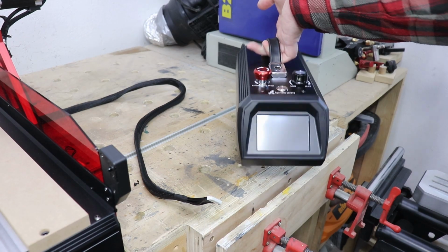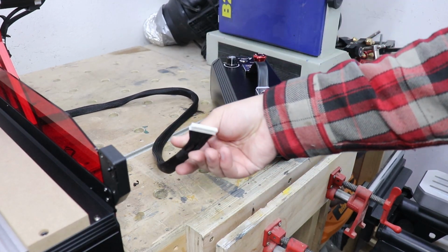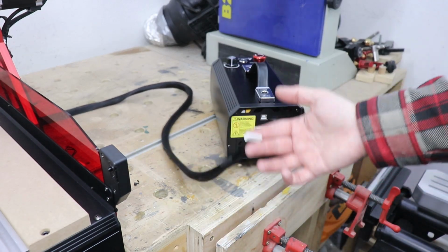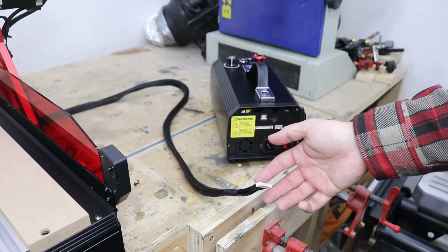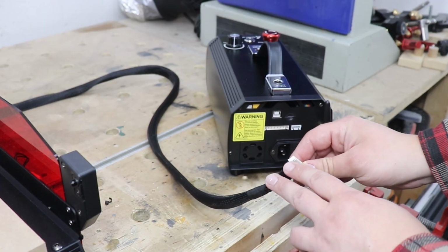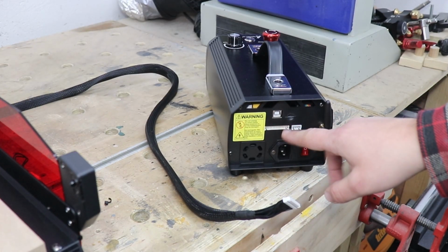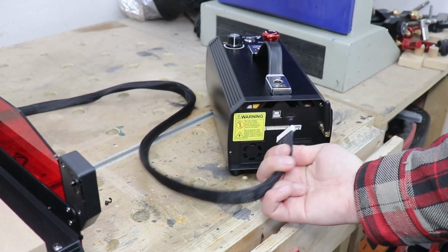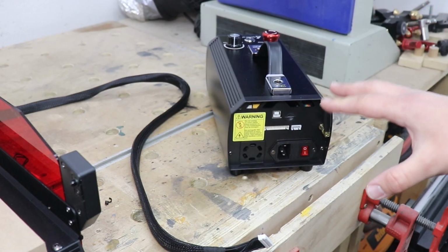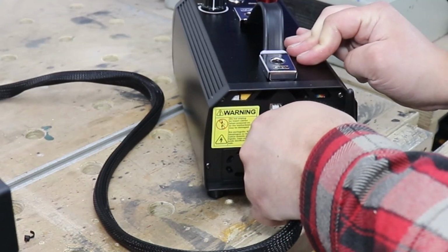In this set, you do get this controller for the whole machine, and the last wire that we've got left needs to be connected to this controller. It's very important that this cable and the one that we added to the Z-axis are the correct way around. Okay, so check the side pins on them. They need to correspond with the entrance, as if you do it upside down, it may short circuit this controller. So be careful of the way you're connecting your wires.